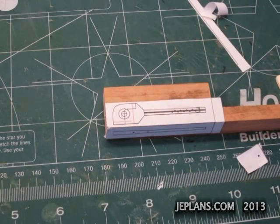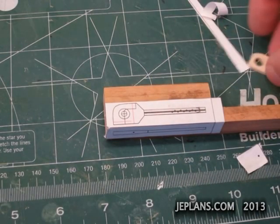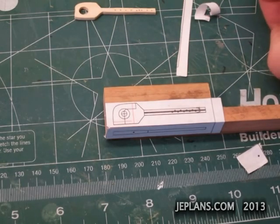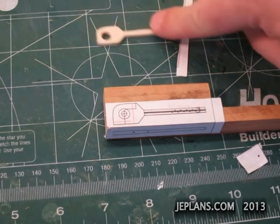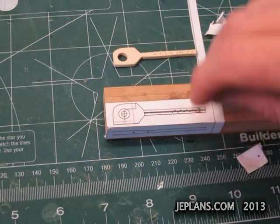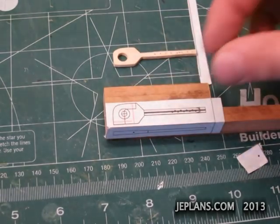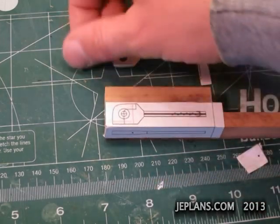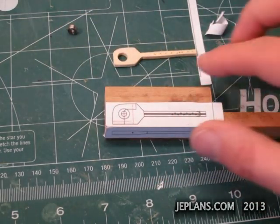For the bellows connecting rod, I'm going to put a bearing in it. This was the test one. I'm going to forego the idea of having it be serviceable with the pins that open it up. I'm going to drill it out to take the bearing and put it right on the shaft and keep it there.